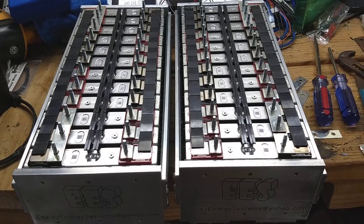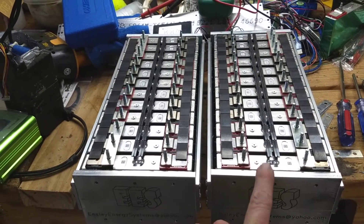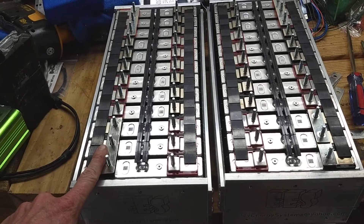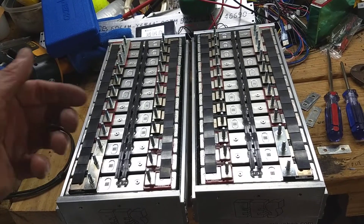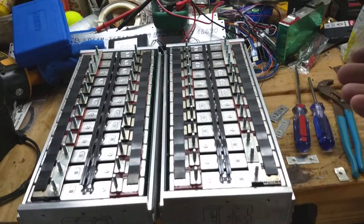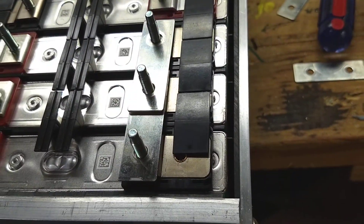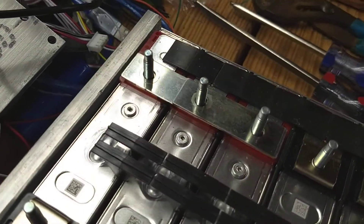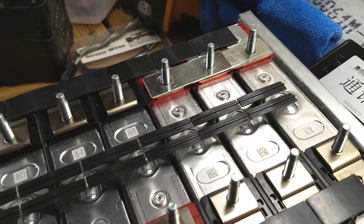What we have here is an almost complete 150 amp hour battery — it's a 75/75 running in parallel. The way you wire this up is you'd have a negative bus bar here and a negative bus bar here, so you have negatives coming out right here — three negatives here and three negative wires coming out here. Up on top you can see the difference: the black wires and black plastic are negative, and over here you've got the red plastic, which is positive.